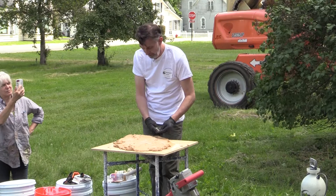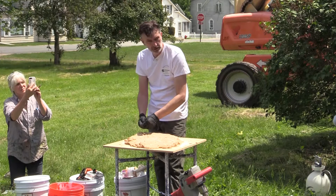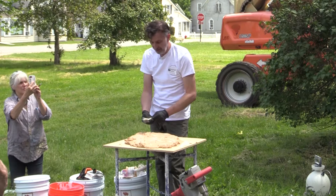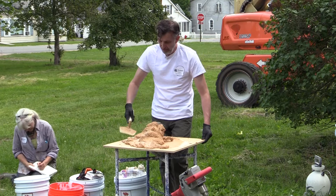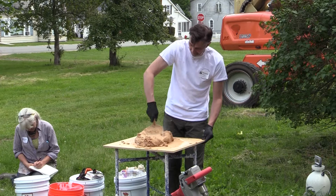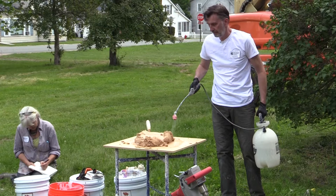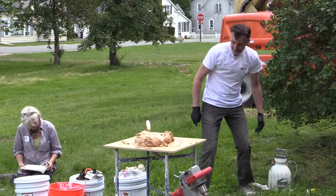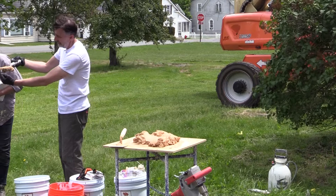I try to cut the hair down to one-and-a-half to two inches — if it's longer than that you'll have trouble getting the plaster through the lath keys. You should also be checking moisture level; you can feel it starting to stiffen up, so give it a spray. These garden sprayers from the big box store are indispensable. I'm looking now to see the hair getting evenly distributed — targeting one hair every eighth of an inch.